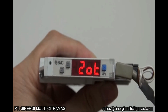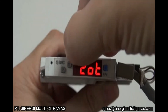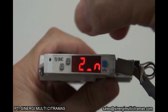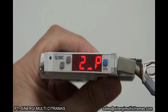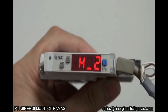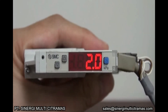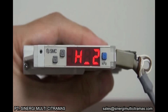The first step is to set the output. Normal output is indicated by 2_P. Reverse output is indicated by 2_N. In this demo, we shall set to normal output. Press the S button to save it. The next step is to set the value of H2. When the vacuum pressure falls below the set pressure by the amount set in H2, the supply valve will turn on again and increase the vacuum pressure.